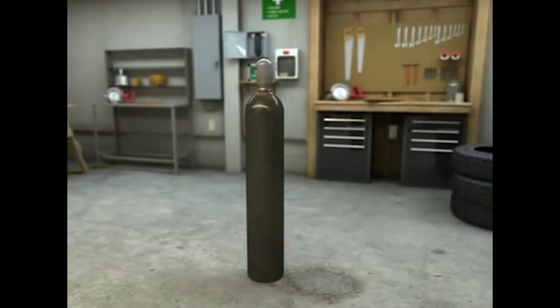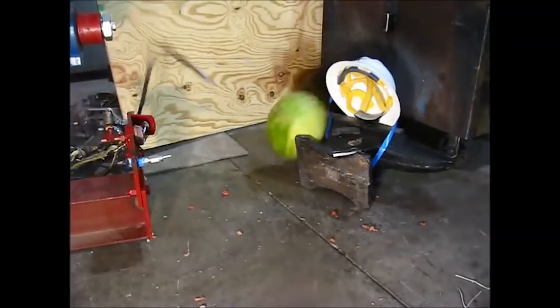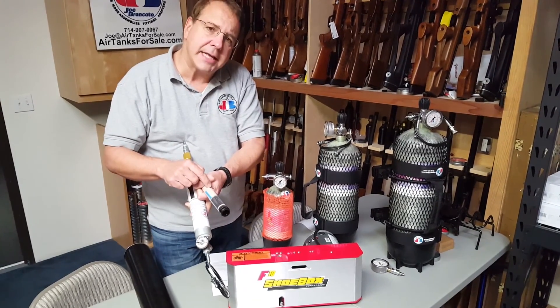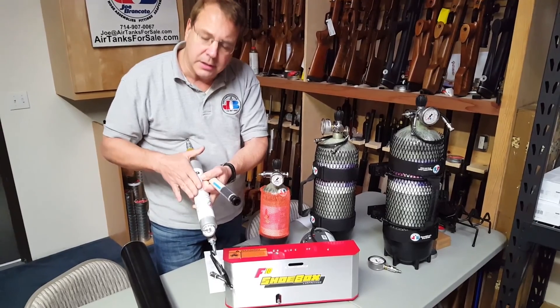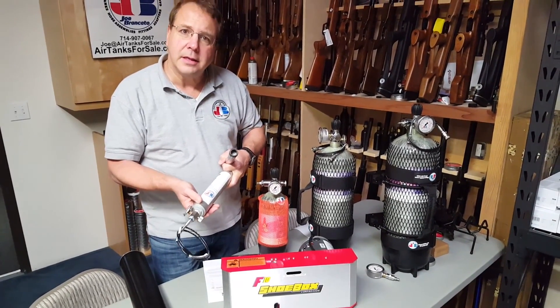Compression of gas represents a tremendous amount of stored energy. If the outlet valve is broken off, the sudden release of compressed gas can turn the cylinder into a missile with enough energy to shoot through a cinder block wall. This video is capturing someone about four feet away from an air compressor that exploded. If the tank looks old, throw it away — these tanks rust from the inside out. Also, never let desiccant beads contact the aluminum surface, because these beads leach acids once they get moist, and that acid touching the metal pressure vessel can eventually weaken the threads.